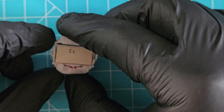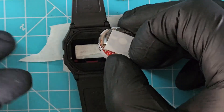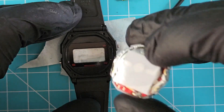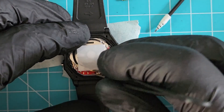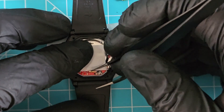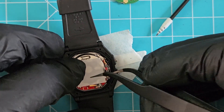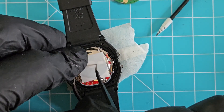You can set this while it's in the watch too. You might notice a couple of cat hairs on everything — that's because I've got a cat. We actually have four cats in the house, which is a lot of cats. What we really need to make sure of is that we push in all of these pushers — if one pushed out, you're going to have a bad time getting this back in. Put it in as straight as you can; it should just go down. If you have to use too much force, it's probably not right. This might be a bit of an issue — I'm not sure how straight this actually went on, and this might affect the tone when I put the back of the case on. Make sure all of the pushers are clear; press them all in with your tweezers.